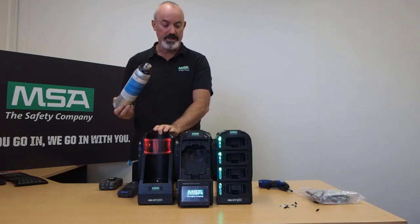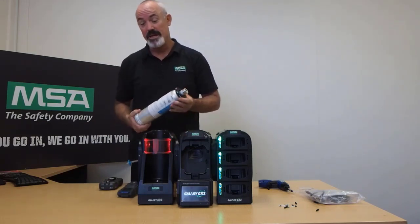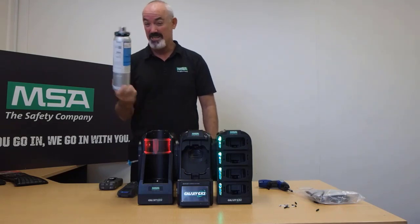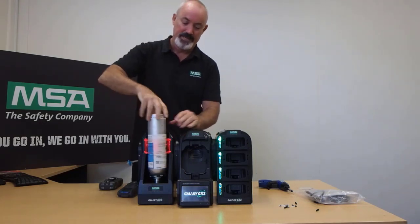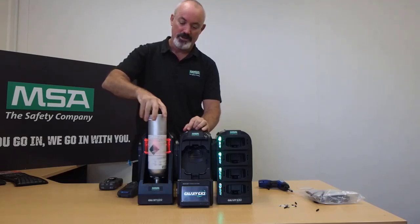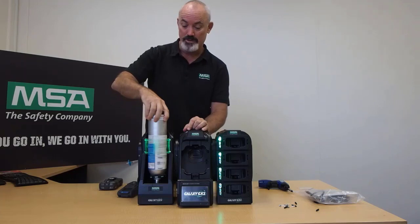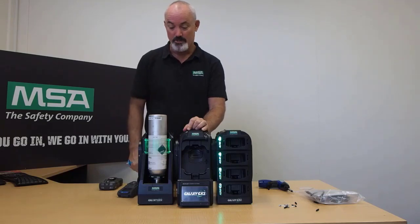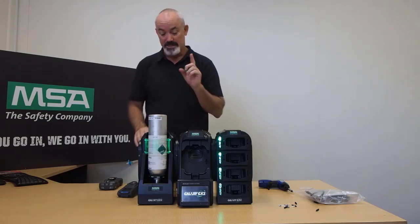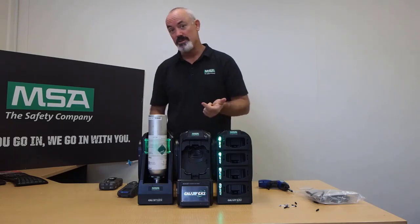With the electronic cylinder holder, we've got a red band here — that's our visual notification that there is an issue. That issue will go away when I put a cylinder in, and the band should then go green, which signifies that everything is good. Red means bad, green means good. If it was yellow, that would indicate an issue to be dealt with — probably that the cylinder is within four weeks of its expiry date (which is the default, though user configurable) or within 100 PSI of its expiry.